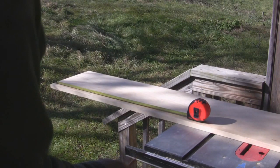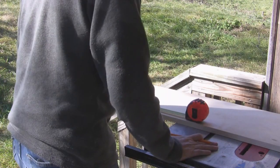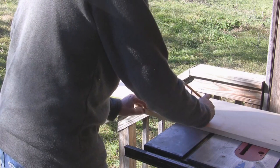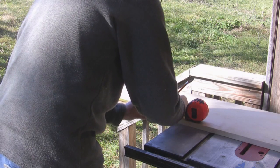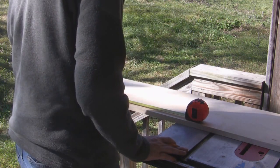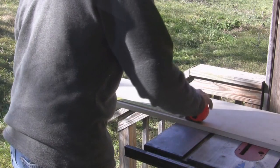You might be asking why this is so small — only four cubic feet. Well, it's going into my apartment in New York City, and I have a very small space that I can put it in. I'm going to be marking the outside to 25 and a half inches and making a cut there, because the three-quarter inch thickness of the 1x is going to add up to an extra inch and a half. Let's make that cut.